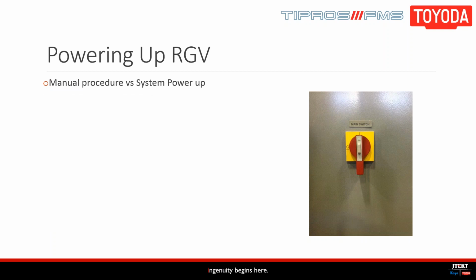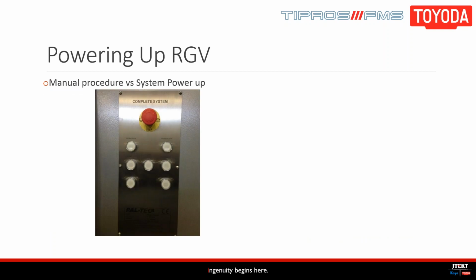Next, you'll press the power on button and wait for the NC in the machine to fully start, and then press ready to start the main hydraulics. When you do this, the ready lamp on the load station should activate as well. Then we'll press the zero return button and wait for auto return on the program to execute. And if you do have a warm-up program on your machines, you can press warming up here to execute that as well. Finally, we'll put everything in auto cycle by pressing auto cycle and verify that it is on the machine as well as the load station operator panel.